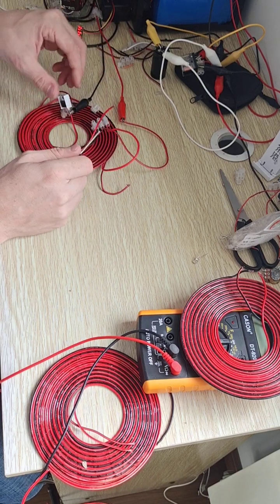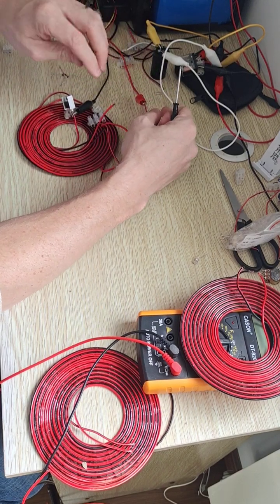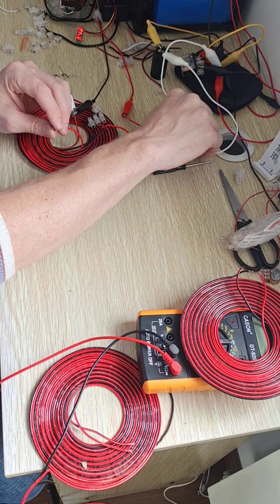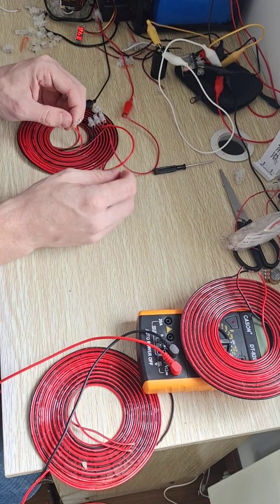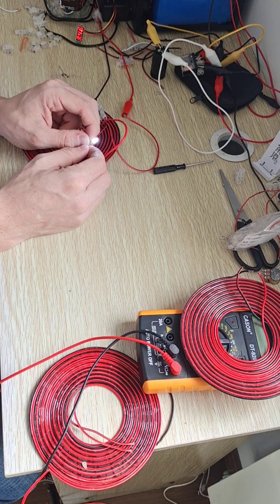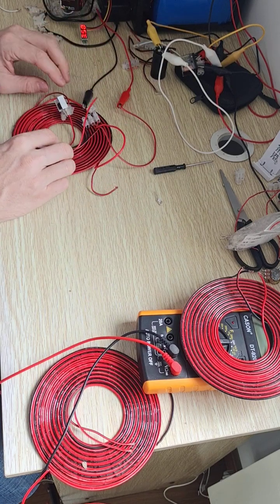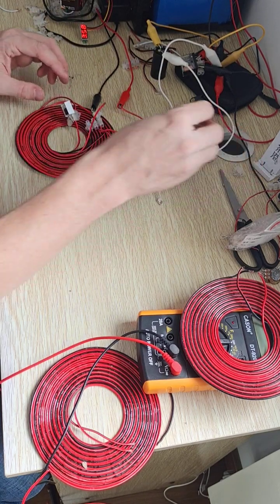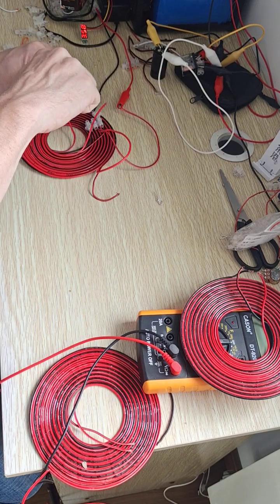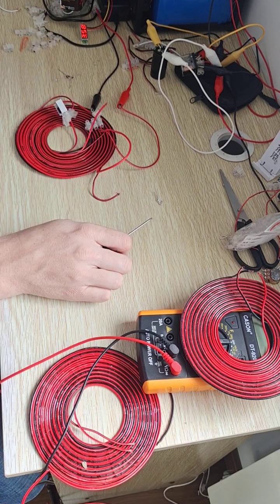The transistor shouldn't get hot, but you know it's working by your transistor being a little bit warm. There we go. That's made something happen, I think. One more try. It's just so bizarre it works for like a second and then it doesn't work. So you're getting your LED lit, no problem there. I think I need to put a pickup on the negative wire, on the negative out of my transistor.